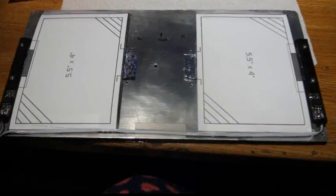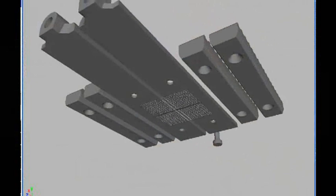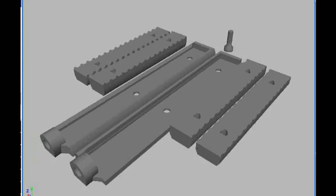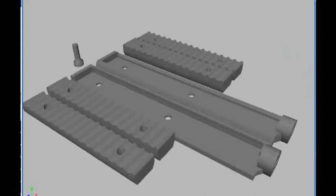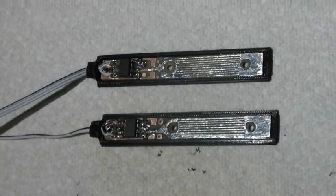The whole thing is mounted on a piece of aluminum plate, then spongy packing material and a chunk of a camping pad for more comfort. I was going to simply use the Arduino to read the capacitance, but was concerned about long lengths of wire involved and possible resistance at the plugs, so I opted to use a pair of 555 timers to send frequencies of each pad instead. This was guaranteed to work right off and can be adjusted just as easily — plus I have all these 555 chips sitting around doing nothing. Here are the little boards in a 3D printed carrier which will clamp down on the layers of tin foil tabs protruding from the outsides. The same clamp setup is on the inside, directly to the plate, which is common for both capacitors.